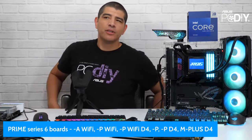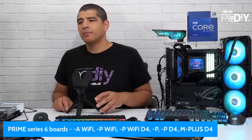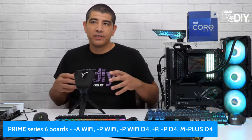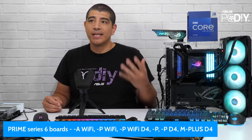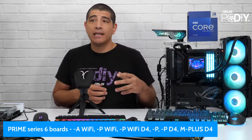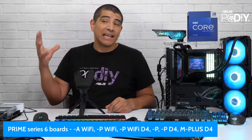Hey, Arnold, so pricing is an interesting aspect. One important thing to keep in mind when you talk about any pricing assessment on motherboards is that some users want to compare cost to prior generations, but you have to take a look at the overall complexity of boards. Even a Z170 series motherboard, which was quite feature rich, had a less complex PCB layer design with fewer layers. The vast majority of motherboards now are at least 6-layer, if not 8-layer.